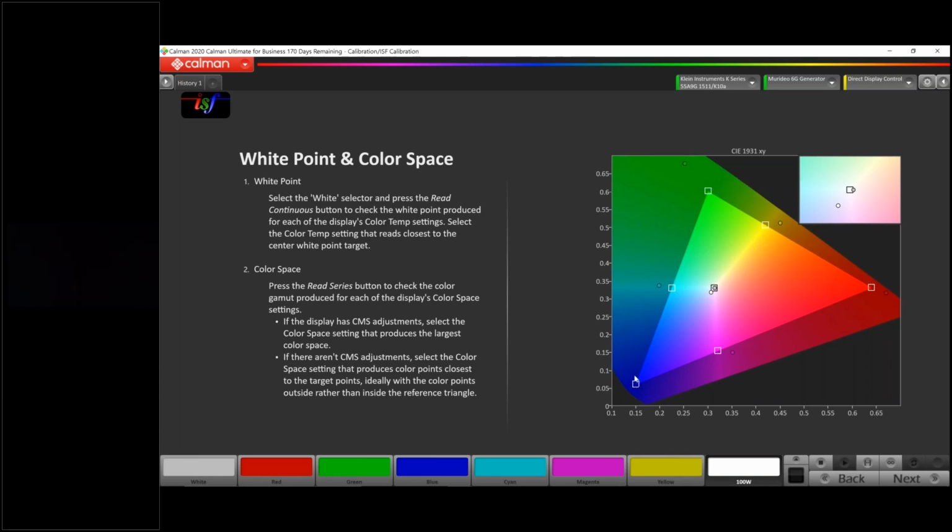The color triangle is still way too big, which might work for HDR content, but right now we're working on SDR. So if we look at SDR content with this big of a color gamut, that's where you get things like orangish skin tones and losing details in color and those types of things. Plus also, colors in nature and things just kind of look fake and cartoony, and it's something that you want to avoid when you're going for accuracy.